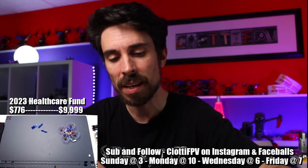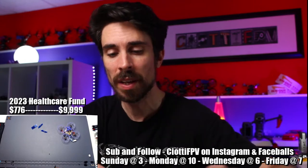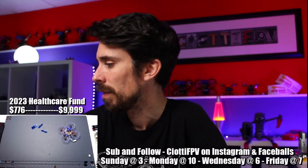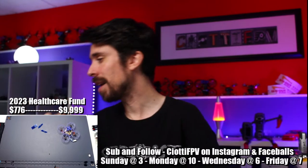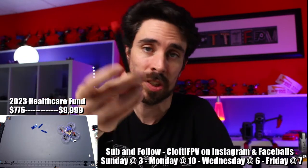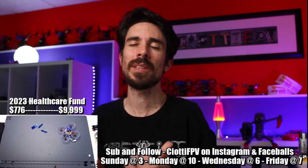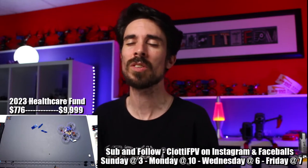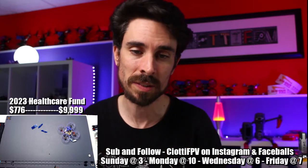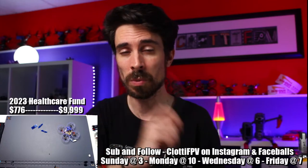So I'm now going to take these Hummingbird 802 25,000s off, and I'm going to swap on some 0702. Well, I don't have another battery. I should put bi-blades on these motors now and try it with bi-blades, but I'll just tell you what would have happened if I'd done that. It doesn't have quite enough power. The PID loop is working a little bit better because the propellers are lighter weight, so the response time is less. But it doesn't have quite enough power because 25,000 kV is just not quite enough for the bi-blades. But we're about to go up to 29,000 kV, which is beautiful for the bi-blades.